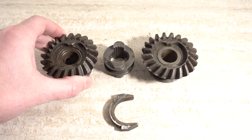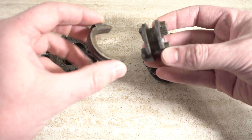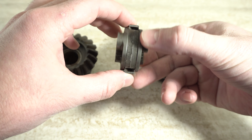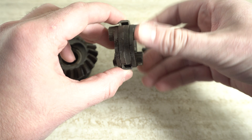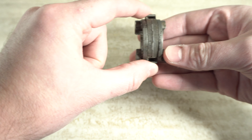This is how it actually connects. The way you move the clutch is there is a little piece that fits around the clutch dog and just rotates. As the clutch dog rotates with the gears, this piece stays in place — this is what allows you to move it back and forward.